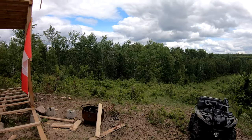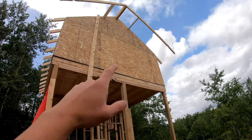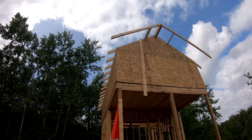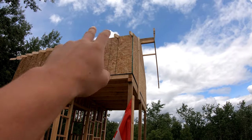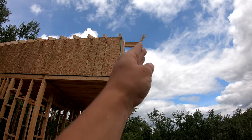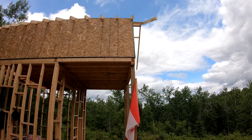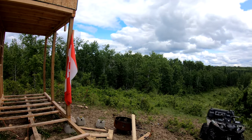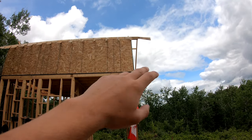Got all my overhangs started here — I've got them all lifted up with one horizontal board across. I can't remember what the proper framing terminology is for those horizontal boards — let me know, it's driving me crazy. It kinda looks funny that I have my bird's mouth cut in the overhang rafters — totally forgot to exclude that. What I'm going to do now is start putting on my end boards, and I want to put them on before I put too many of these horizontal pieces so I keep my rafters straight instead of developing a bend. These are 92 and 5/8 boards — I really should have longer ones, but I don't have the luxury of complete economic freedom. Gotta use what you got.